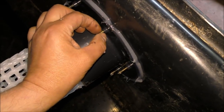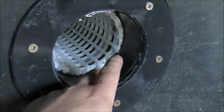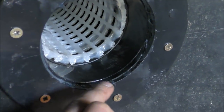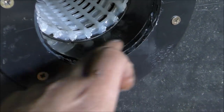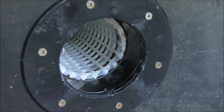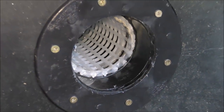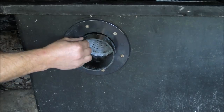And you see what I'm saying about the screws? They're sticking through quite a lot. It's not going to be anywhere where I'm going to catch it, but that can be taken off with a grinder. Now I've just whipped the pipes out that I used as a guide to get me through the hole to line it up properly, and you can see that as I've screwed these screws in and drawn everything together, the silicone has actually come through and it's totally sealed it up, front and back basically. It only needs to be sealed from one way because we've got a piece of solid pipe going through here. Our fitting goes through the tank, so there's no possible way the water can get out of here now. That is, unless it comes out of a little pipe and goes through into our next container.